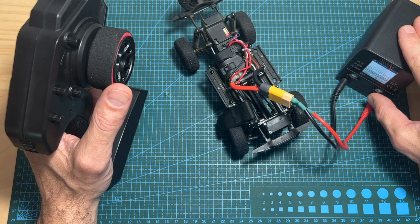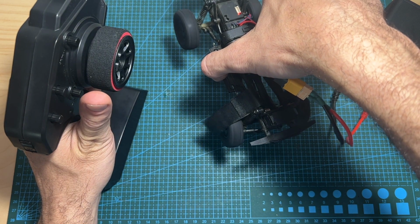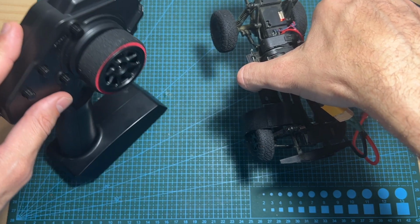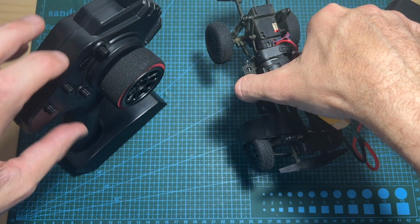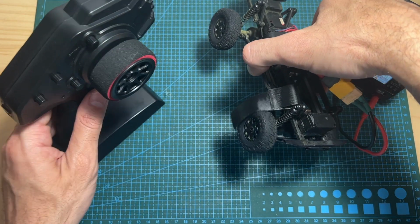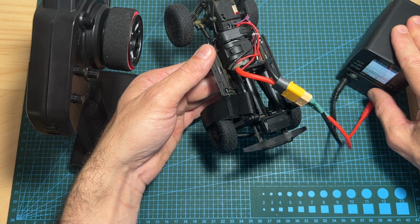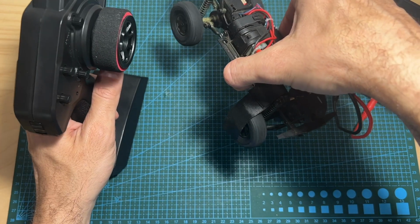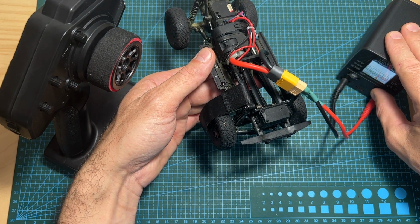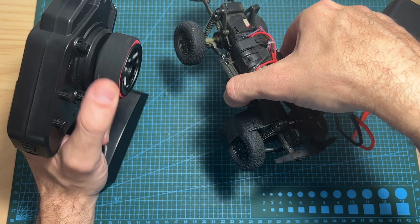And finally, let's test it on 8 volts. Now it goes over 1 ampere, 1.23 amperes. You can see that it's working, but steering becomes very problematic. So I'm going to try to limit the steering. So steering is not very successful using the car on 8 volts. So let's get it back to 7 volts. Still not very good, and finally back to 6 volts. Now it's good again.